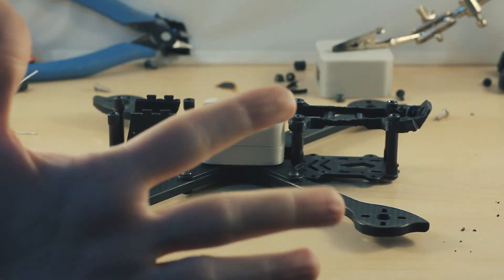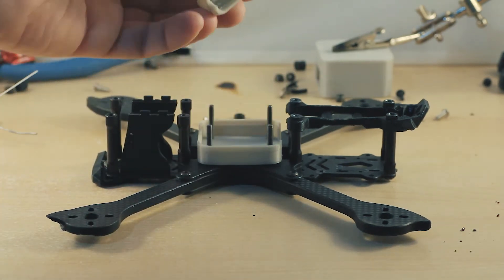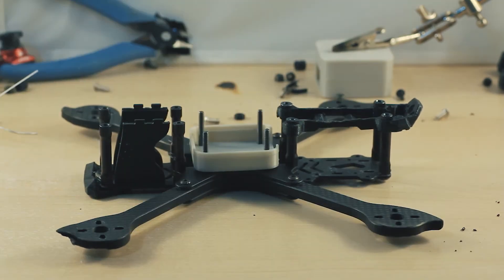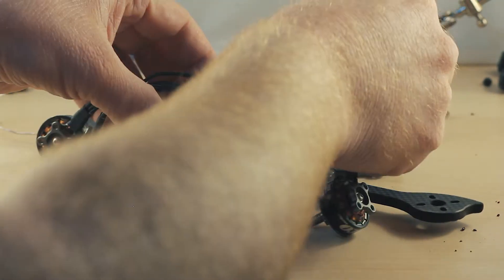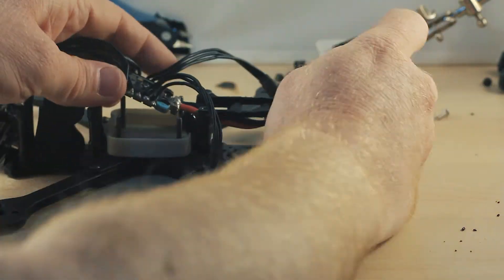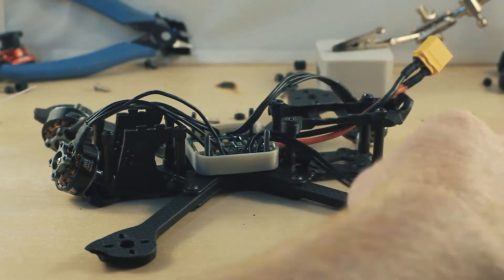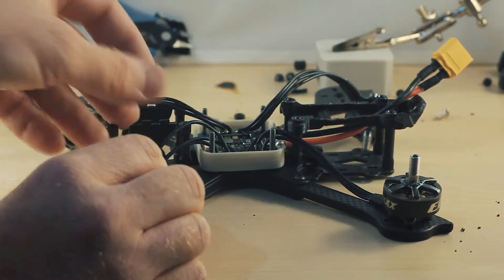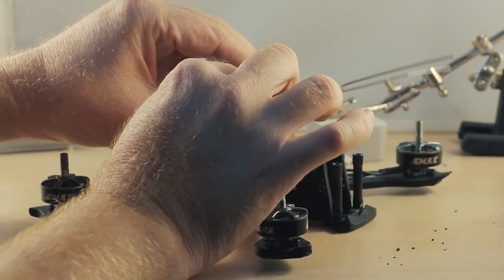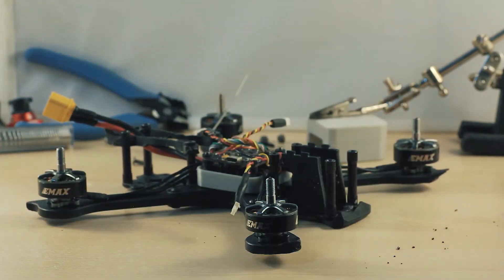Wait, let's go back a bit. This is not some crappy DJI shell — this is my own invention: the Stack Shack. Really just a prototype at this point, but I'm hoping it can keep everything clean, and in later versions, eventually dry. Both the ESC and FC easily fit in the box, with indents for the battery strap in the lid — a level of protection unseen in racing and freestyle quads. Future versions will include an extended section for the cap and battery connection, as well as a modular motor wire pass-through to stop leaks.